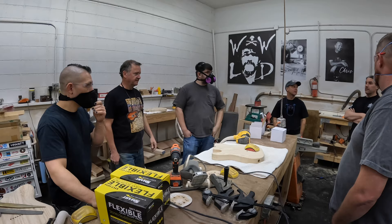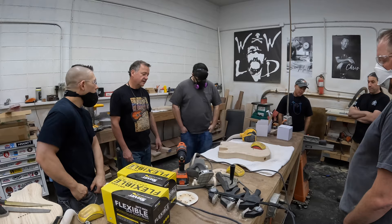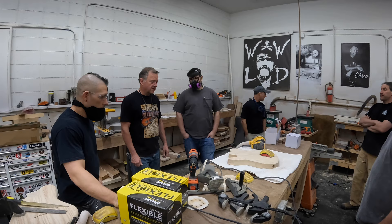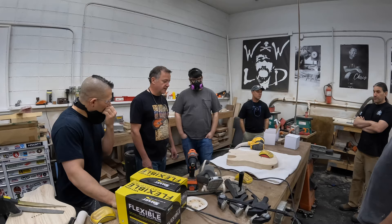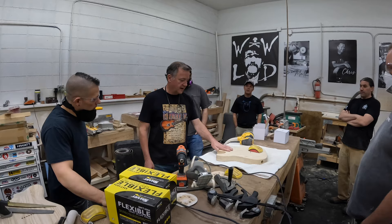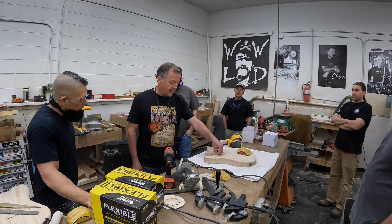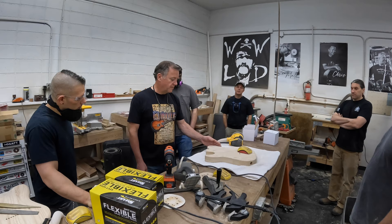Don't keep doing a better job by spending more time doing it. What can happen is you start rounding things off — you want the parts that are supposed to be soft looking soft, but you want parts that are supposed to be hard looking hard. The place where people screw it up is the horns. So on a tele body or on the batfish bodies, keep everything as flat as you can and do the bare minimum to get rid of burn marks and make everything kind of round on the edges. Don't make it more round than it already is — just bring back the little bit of roundness that there is.